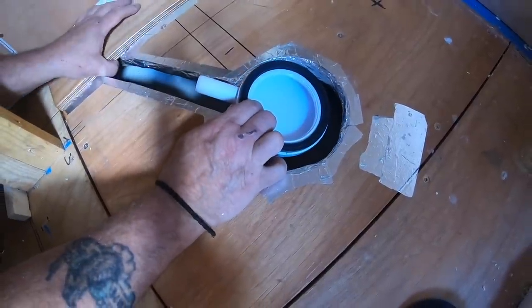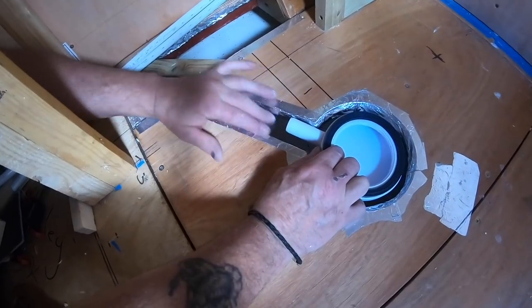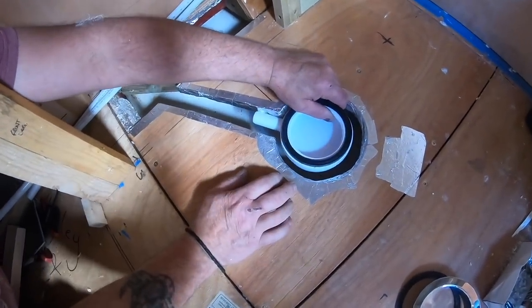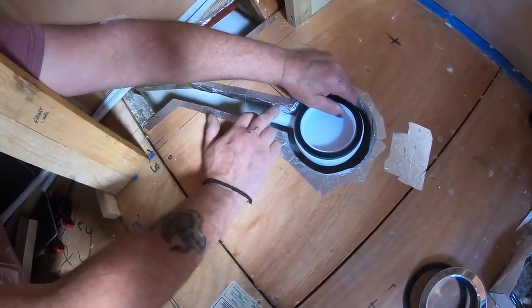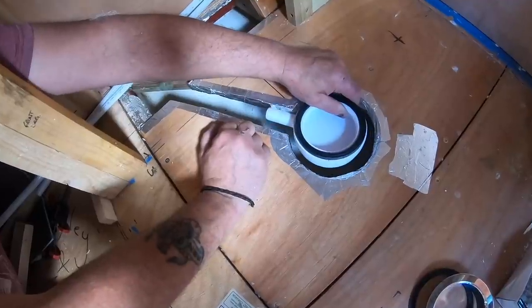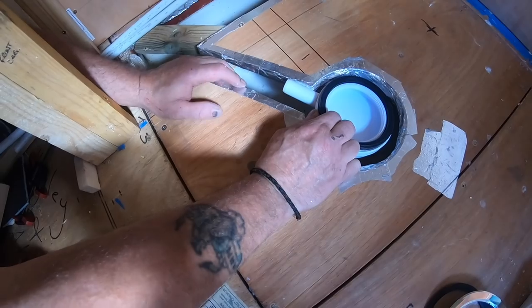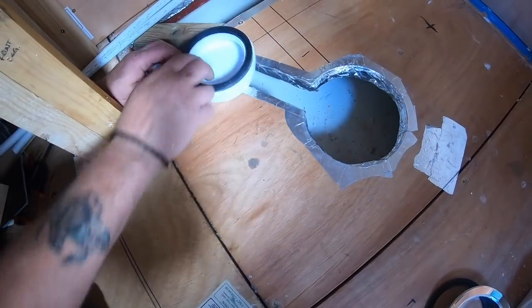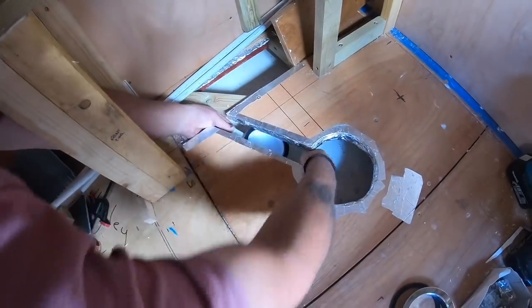And what we've done is we've created this little space here, and the reason we've got this channel in here is because the way that this sits, as Sod's law would be, it's right sort of halfway through the thickness of the ply, so I've had to create this channel. So anyway, I'll be able to drop that below the floor, pull on the pipe which is going to be connected to this, and that will drag this waste along there under the floor.